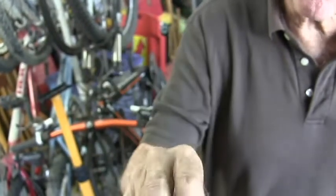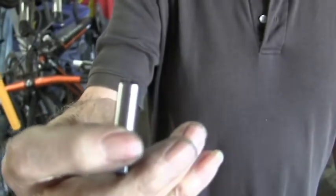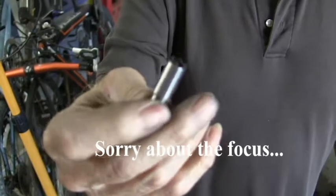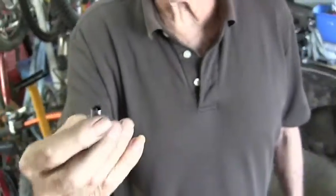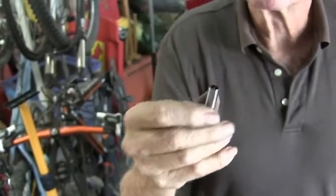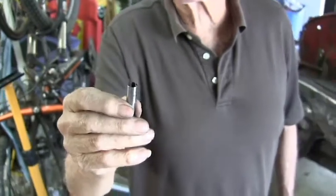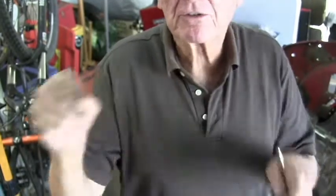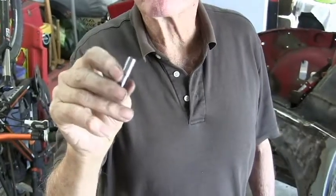So when you push this down over it, I made these four prongs — you might be able to see on there. With the mill, almost like a cutting tool of some sort, but it's not. Anyway, I made those four prongs, but they were way too long and when I tried them they bent over. So I went back to the shop and cut them shorter, and I had made this sleeve to slide around them hoping to keep them from spreading apart. I silver soldered it on there over top of those things. With the sleeve it should be strong enough.